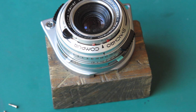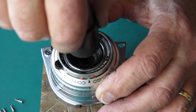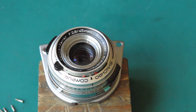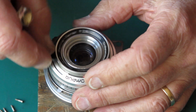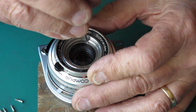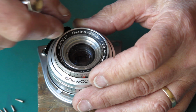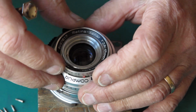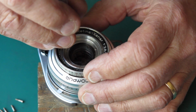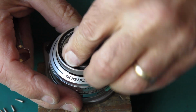This name ring may well unscrew. I'll have to test that out. Well, I think a friction tool here is actually the solution. Remove that black conical piece, and 3 screws become exposed. And I think that I should be able to unscrew that lens with a bit of effort. Let's try slackening those screws up. This is the focus adjustment, I believe. I should be able to roll this lens right out. Yeah, that's just unscrewing the whole lens now.